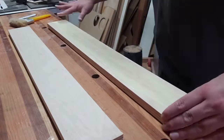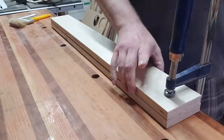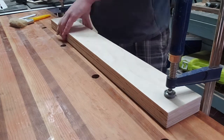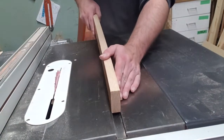Get the three-quarter ripped, get it glued together. There was a slight bow in it, so I glued the bows together — you can see it's cupped in the middle. Glued those together to drag them both flat, and clamped it against my workbench so that it'll come out nice and flat.